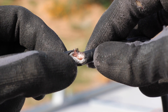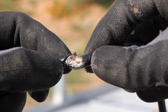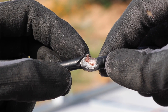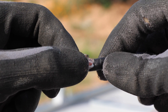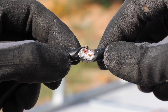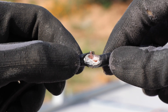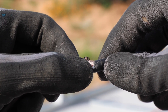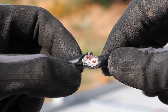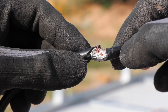You can see here that I cut basically through the neutral on the wire. A lot of people would typically just put some electrical tape on that and call it a day. Since I nicked all the way through the neutral and there's only a few strands holding it together, the tool still works — but it's not ideal. If I tape this up, the wire is probably going to get a lot hotter because it's pushing the same amount of current through a smaller space, and it could melt the electrical tape.